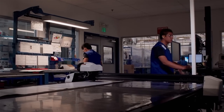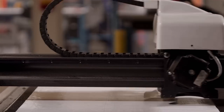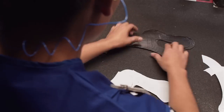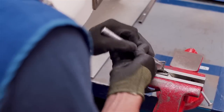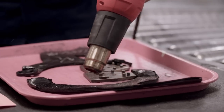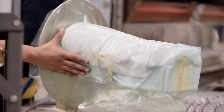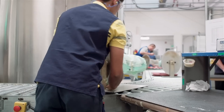In the case of CTI, the raw carbon fiber is precisely cut using CNC technology. The hinge arms are then fine-tuned, and the carbon fiber is hand shaped to fit the 3D leg model. Once the key components are in place, the carbon fiber is cured under pressure.